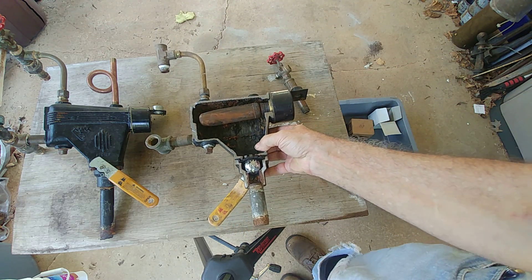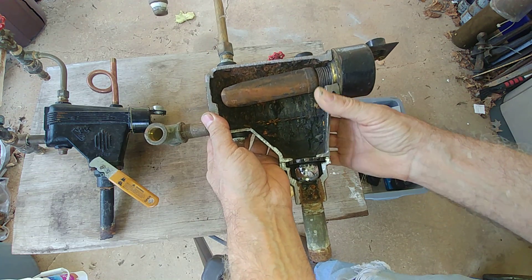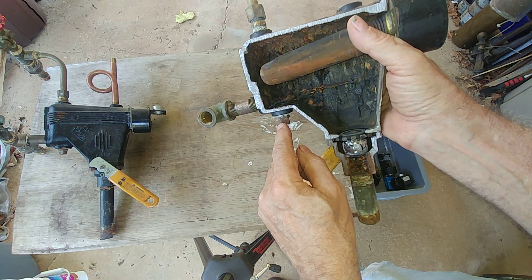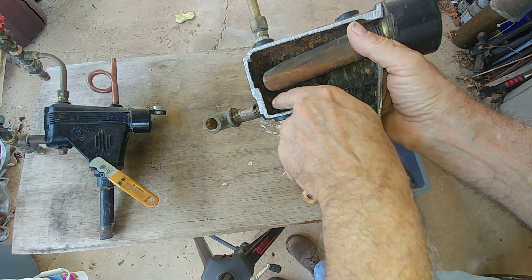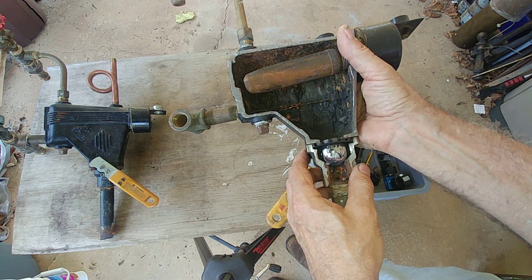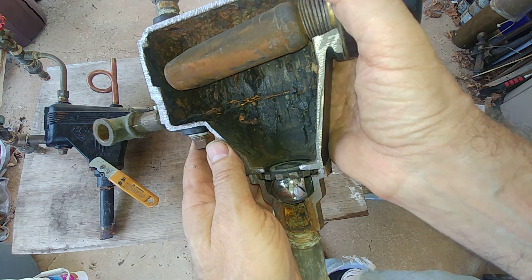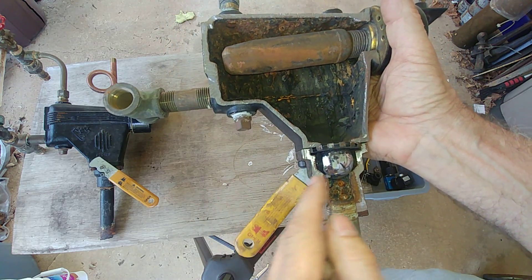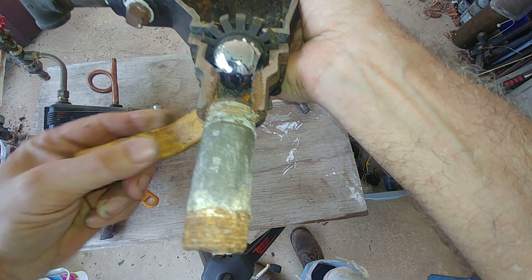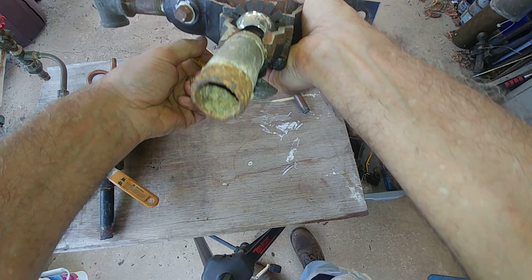Here's our cutaway version of the 67. There's your brass outlet — a clot will often form there, so sometimes you have to get inside to break that up. You can see the inside is pretty crusty. This is a close-up of the ball valve, so when you blow it down, that's what's actually happening right there.